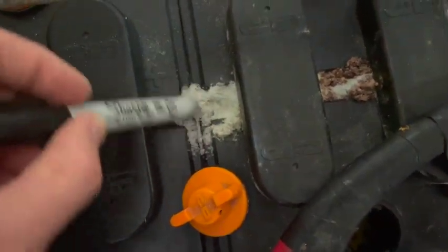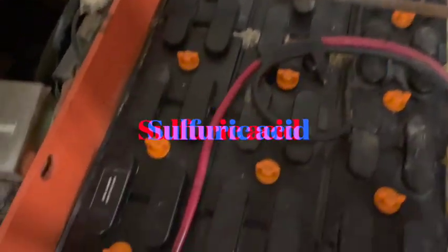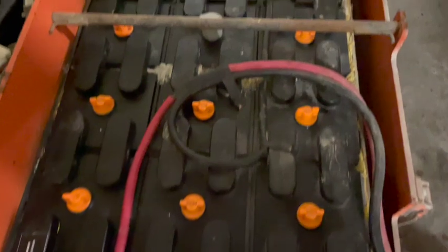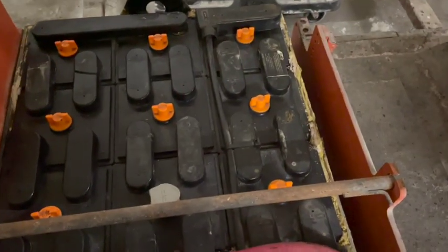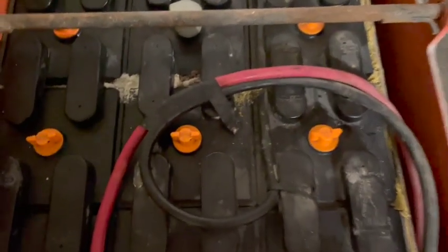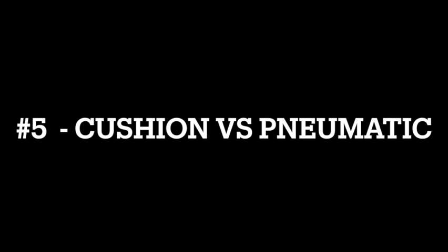Number four: what's that fluff? Don't touch it without gloves. A forklift battery is filled with an electrolyte of water and sulfuric acid. During charging, the released gases leave a residue of sulfuric acid which gradually corrodes metal components, leaving a fluffy yellow-white powder. The powder will gradually damage battery terminals, cell caps, cables, and other parts, and the residue should be removed.